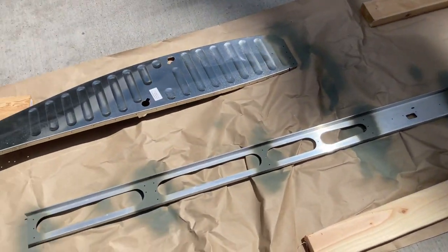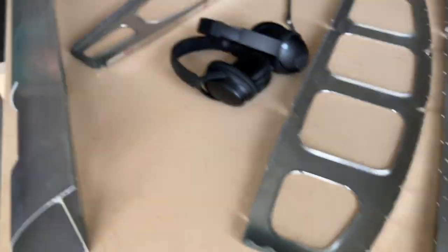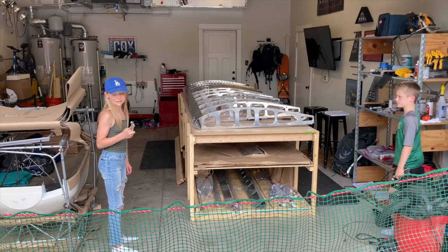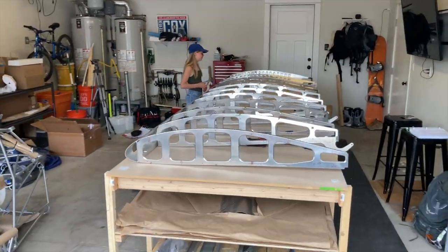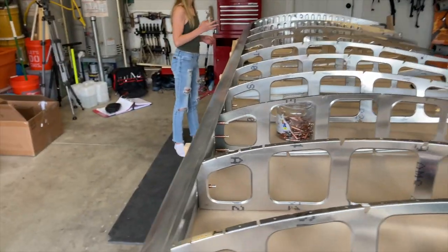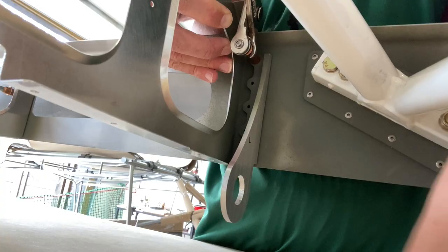Finally a non-rainy day. We're tidying up the primer areas and figuring out where stainless steel rivets go through all the ribs and the spar. Clecoing the ribs to the forward spar. Now that people can see kind of an airfoil over at the restaurant, I've got my first couple of looky-loos coming in. Now it's starting to look like a wing. Clecoed the forward spar, and just like that we have a rear spar.